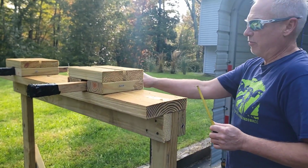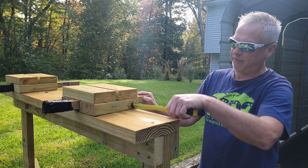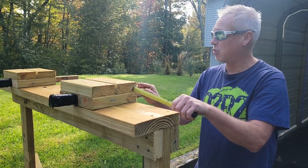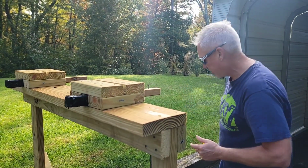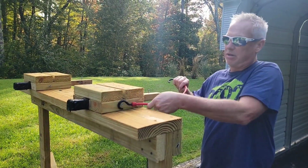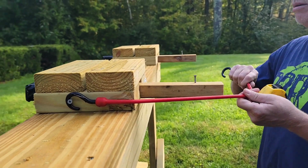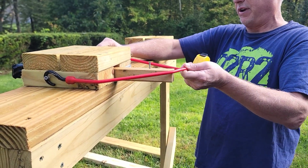So when you build this up right here on the 2x8, just cut some 2x4s, leave about an 1/8 inch gap in between it, so it goes freely once you put the bungee cord on. If you make it too tight, wood swells, it's not gonna shoot in. And what I mean by that is you're gonna take a bungee cord, put a screw here, and then you're gonna come around here and put another screw over here.